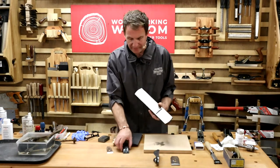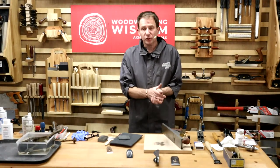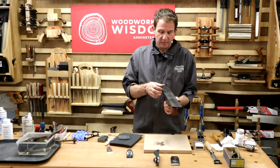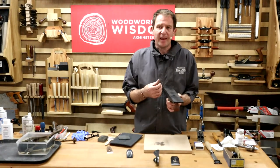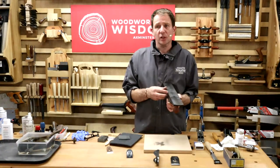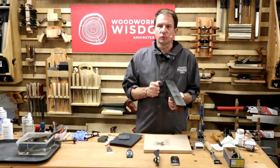And I talked to a good friend we had at that point in here, a guy that used to do some engineering stuff with us, and asked him about this. Metal, if you looked at cast iron, is a structure, has lots of holes in it. If you could magnify it, it's not a solid thing. It has a grain, pores, all right? So little cracks and defects that you can't see with your naked eye. That water got into there, gets into the metal.